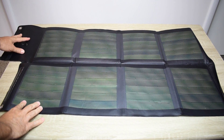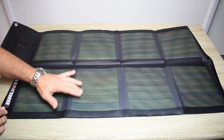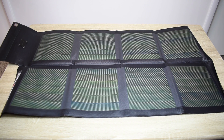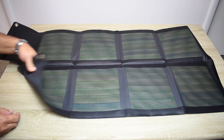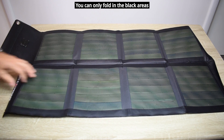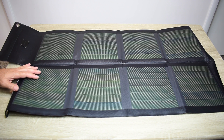Right here you can see the entire panel. With it unfolded you can see it's made up of eight different sections where the film was deposited onto the material, with a waterproof coating applied over top. Because this panel is much older, it only has an efficiency of around 15 or 16 percent, but it works extremely well in lower light conditions. It can be bent a lot, but you can't fold it and make a crease — you can roll it and it's not going to hurt it. Even though this is a good panel and the rating is fairly close, it says 26 watts but I find it to be more like 21 watts. $400 for this type of panel is just way too much money.